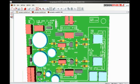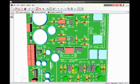So when that MOSFET and this MOSFET has been pulsed, there's a gap, a space, and then this PMOS is turned on by this little baby MOSFET driver, and this MOSFET driver is turned on as well. So I've got balance controls to balance between the NMOS and the PMOS. There's a trimmer for each of the stages for balance, basically in series with the biasing. And the biasing is down here.